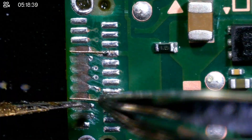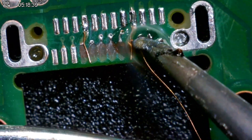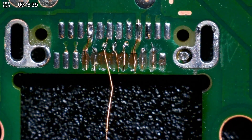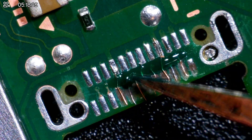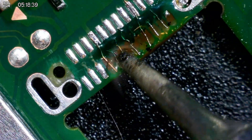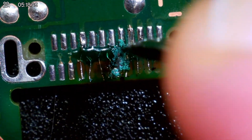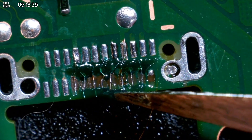I was trying to clean as much as I could on the go whilst doing this, and also wanted to ensure that all the wires were going to be in the correct places. Here, whilst I was cleaning, I lost trace number three. As annoying and frustrating as this looks, once you got into the rhythm it was actually okay. I then applied solder mask and cured it with a UV pen, both in the middle and at the bottom of the board. Looking back at this, it looks like I put way too much solder mask on.